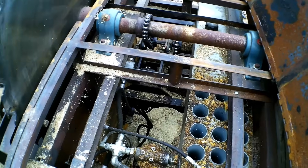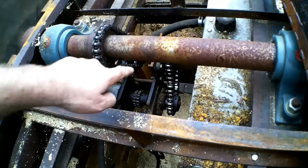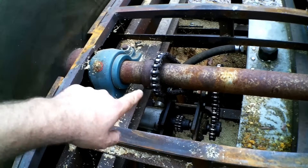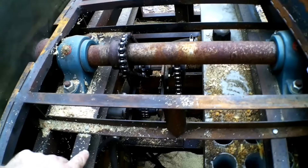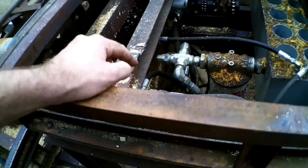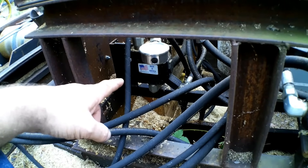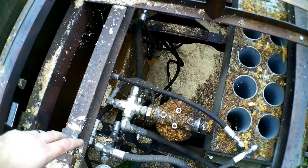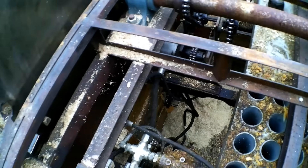Our mill is completely hydraulic driven as far as the carriage and the sawdust augers. We have our hydraulic reservoir here feeding our hydraulic pump, which is chain driven off of the arbor shaft to get the speed up to where I need it. The hydraulic pump feeds a priority valve that sends nine gallons a minute at 1,400 PSI to the carriage drive, and then the secondary hydraulics come off that and go to a splitter valve which feeds the two sawdust augers.